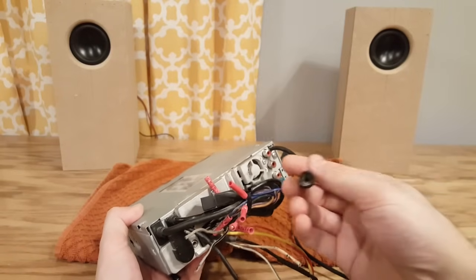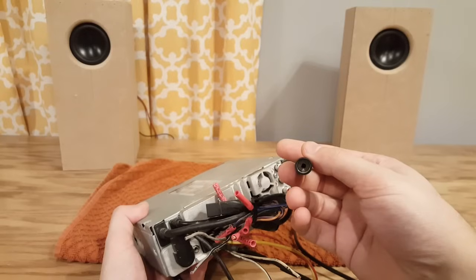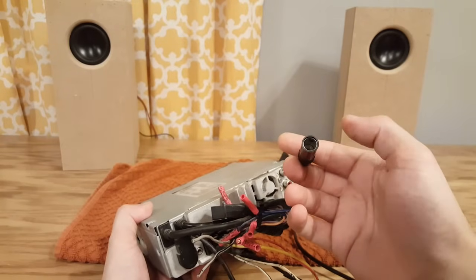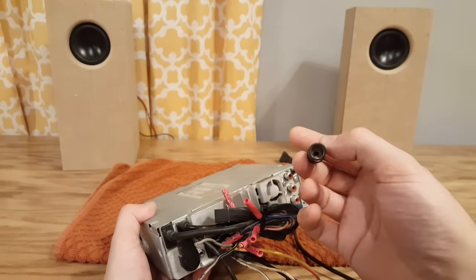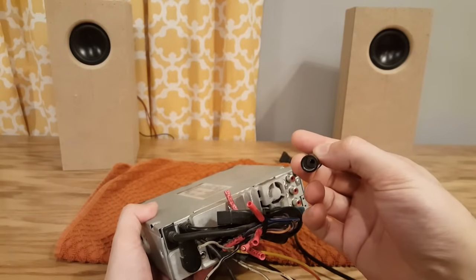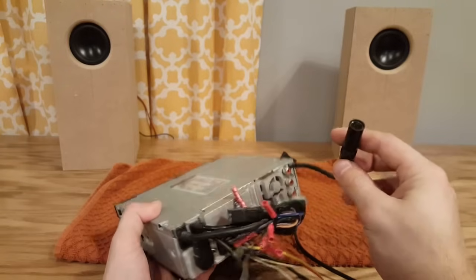However, if you take a look down in the antenna, you see a hole down in there. That hole, you can just take a bare wire or even an insulated wire that you've trimmed down and stick it down in there. Just tape it in and that will give you an antenna. It's that simple. Make your antenna as long as you need to get the stations you want. And then when you get the antenna the size you want, just cut it off. And you've got yourself a homemade antenna. It's very simple to do. And we'll show you that.